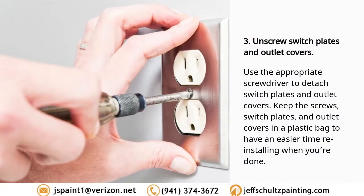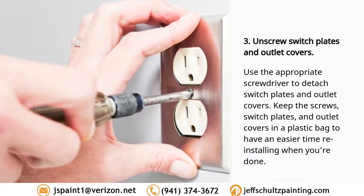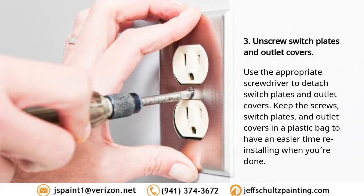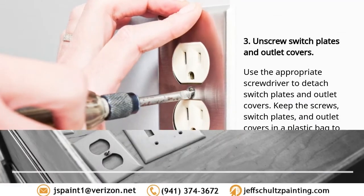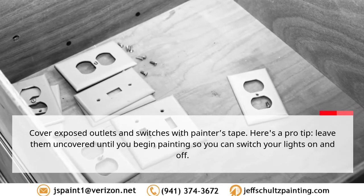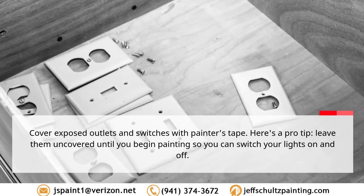3. Unscrew switch plates and outlet covers. Use the appropriate screwdriver to detach switch plates and outlet covers. Keep the screws, switch plates, and outlet covers in a plastic bag to have an easier time reinstalling when you're done. Cover exposed outlets and switches with painter's tape. Here's a pro tip: leave them uncovered until you begin painting so you can switch your lights on and off.